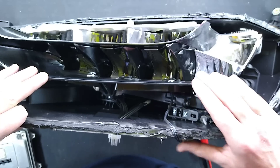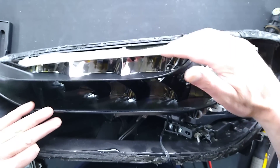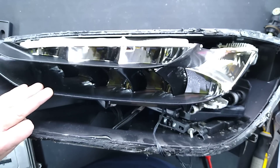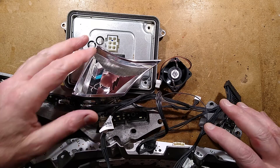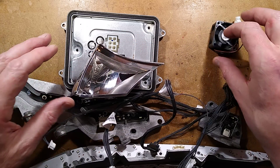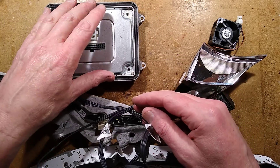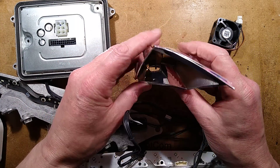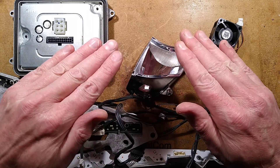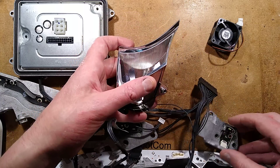This is the dipping mechanism — there's very little movement. I didn't realize the whole thing physically moves inside, but that makes sense. We appear to have a matrix with LEDs firing up into scooped reflectors — it's quite a complex optical design. There's a little air-stirrer fan with a voltage rating of 13.5 volts, suggesting it runs off the auxiliary battery. The optics are fascinating — this unit can tilt sideways to spread the beam, while others tilt up and down to adjust height. It's very small movement but highly optimized optics.